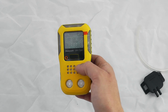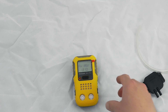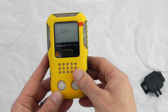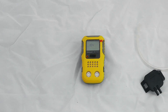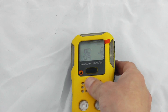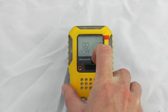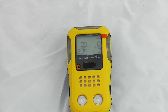It's now going through a series of tests showing firmware revisions, then doing a one-minute startup to get the instrument warmed up and activated. It's now finished its startup procedure and giving us our standard four-gas measurements. This will run for the next two years — there's a heartbeat indicator just to let you know everything's working as it should.